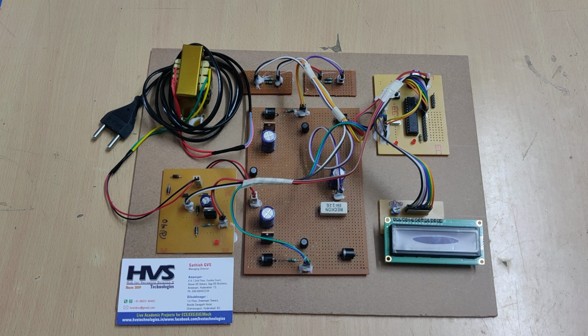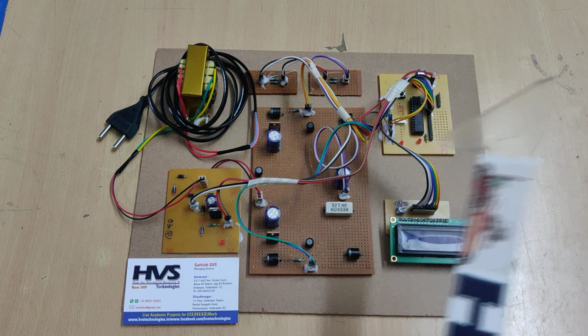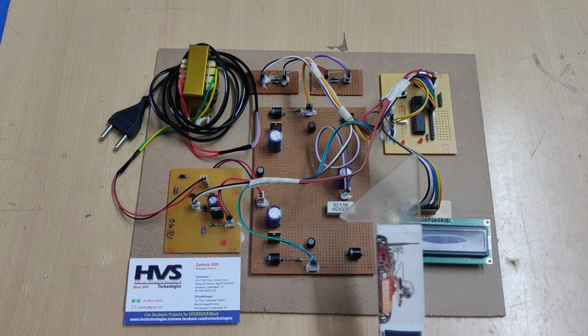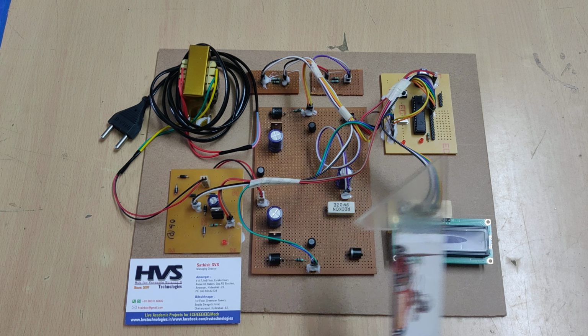Welcome to the project demonstration of Ferdowsi rectifiers, single phase buck boost bridgeless power factor correction rectifiers with low semiconductor count. So generally when we are converting AC to DC, we need to use rectifiers. In rectifiers there are two types, one is bridgeless and one is bridge. The bridgeless is nothing but using MOSFETs to convert the AC to DC.